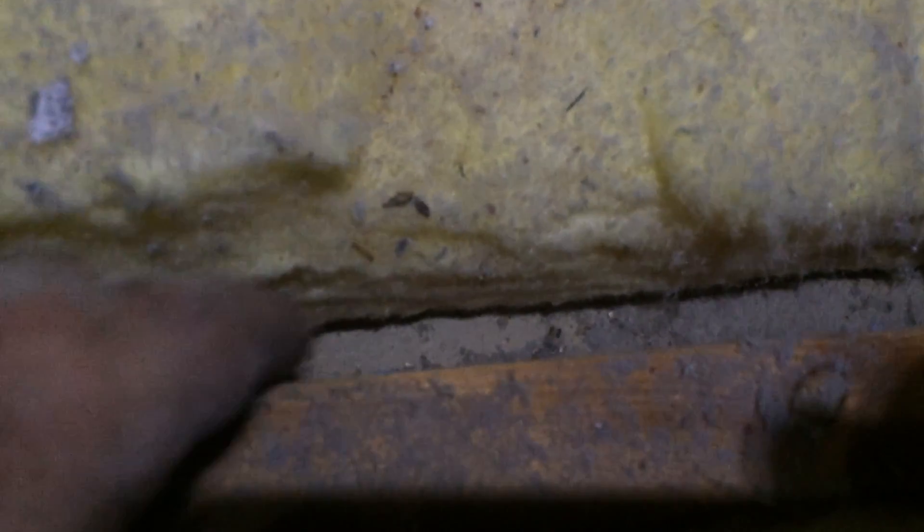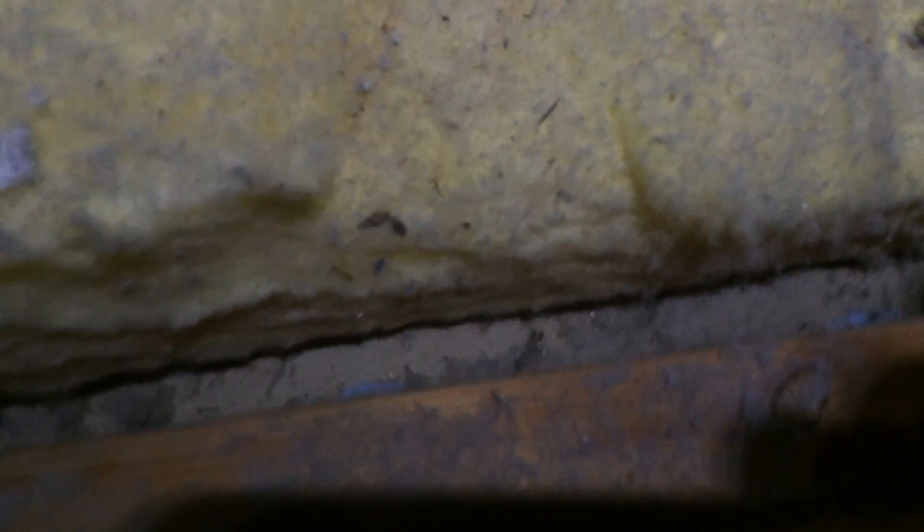The cellulose fiber will kill any ants, spiders, cockroaches — so you'll never have cobwebs in the roof with cellulose. But look here — this is the problem with bats: the bat's not butted in there properly. One percent gaps and you'll lose your efficiency by 30%, and five percent gaps like that and you'll lose your efficiency by 70%.